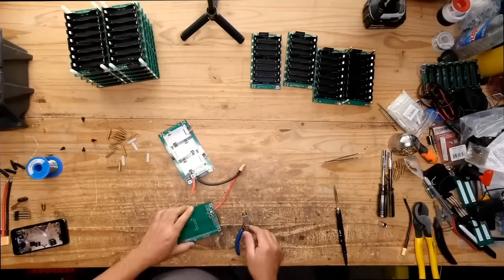It's just the MOSFETs that are leaking voltage. The MOSFETs are these things that are switches that are supposed to let power through. But whenever they're off, they're not 100% off. They let just a little bit of voltage through, and that's why you see 52 volts. It should be somewhere around 60 because each one of these packs was 29 point something, so it should be like 58 volts. Instead, you see 52. So if the voltage doesn't match, then usually that's just leakage through all these MOSFETs.